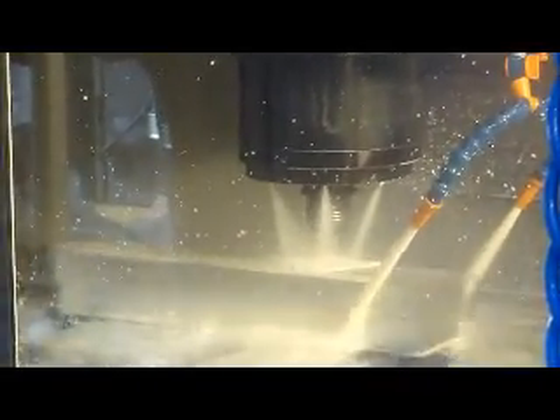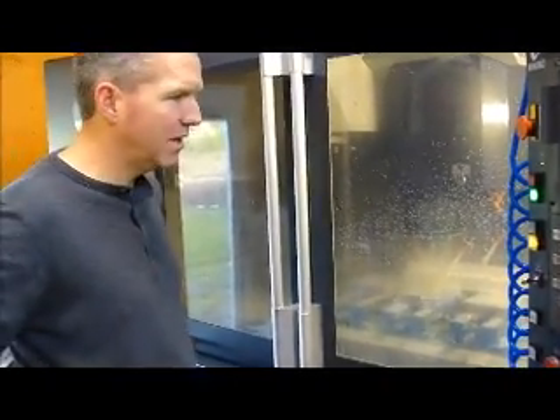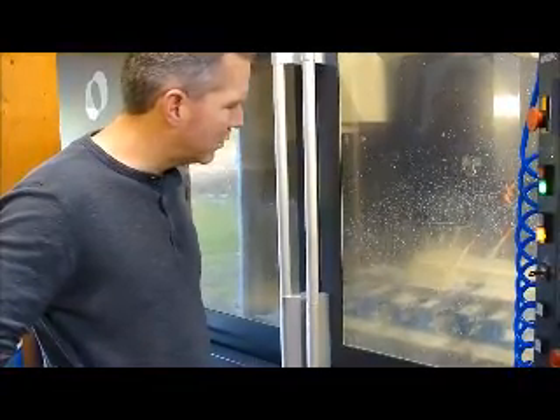I've got to turn it on to cool. Now be aware, this is not in a roughing mode. This is a quarter inch end mill running at a little under 0.6 depth cut and 150 inches a minute, using another one of the high speed tool paths.